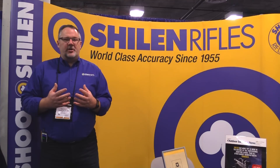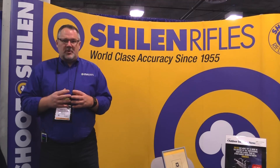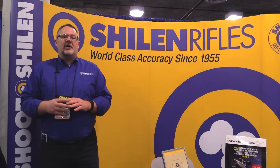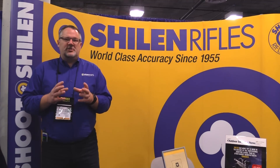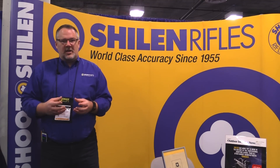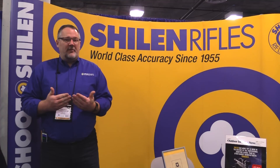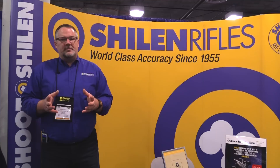What you're trying to do is burnish the lead and throat area of the chamber. Breaking a barrel in is not nearly as much about changing the surface for the full length of the barrel as it is breaking in the edges of the lead, which are manufactured after the lapping process is done. Here at Shilen, we lap every single barrel we make, so burnishing of the full length is not nearly as important.